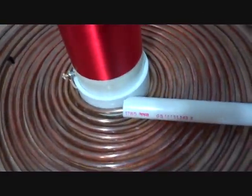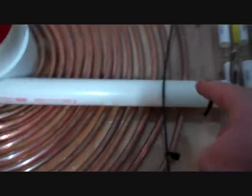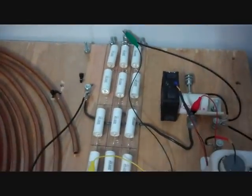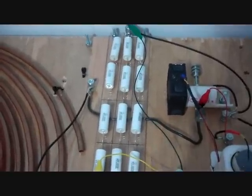Quarter inch copper pipe tubing for the primary spiral. This here just insulates the first turn lead-in from the rest of the circuit. Here you can see the first turn connection. This yellow jumper and the green one go to a bleeder resistor for the entire MMC array. I know that each capacitor does not get fully discharged — I found that out the hard way — but it does take the lethal edge off of it, so it's mostly harmless as long as you don't get really badly shocked. I will be installing bleeder resistors on every capacitor later on.